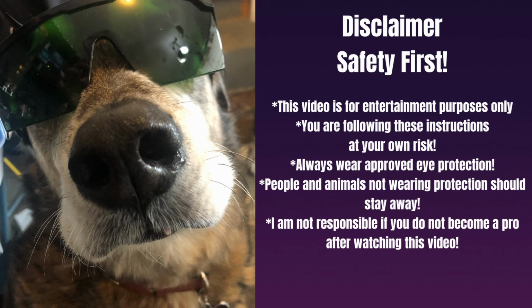These lasers are very dangerous to operate, and they could release some pretty toxic gases from whatever you're engraving. So I would suggest that you are in a well-ventilated area, possibly using an enclosure and venting to the outside. I will be using an enclosure and a filtration system with mine. I suggest that you do the same. Vent outside, use an enclosure, filter the air, so you're not breathing any of it in.